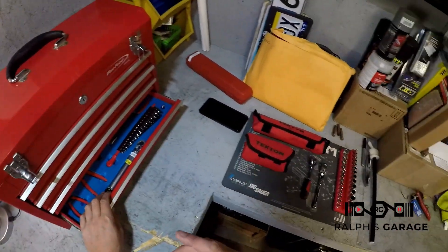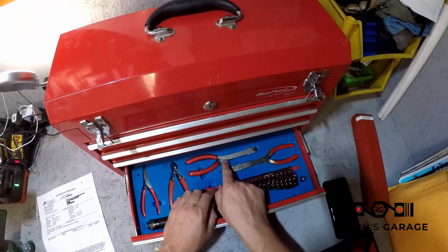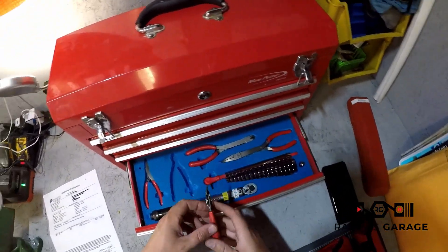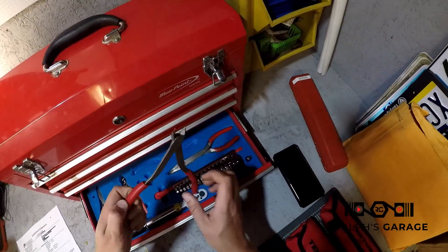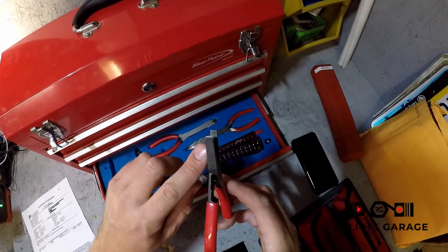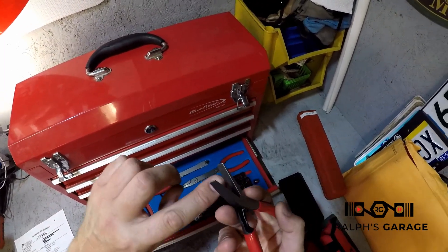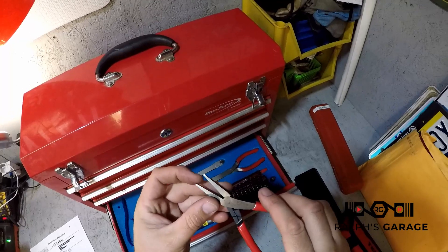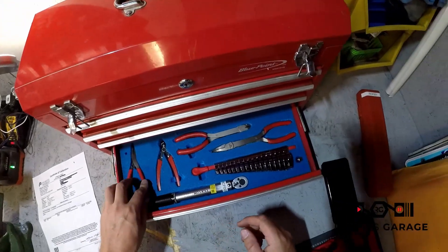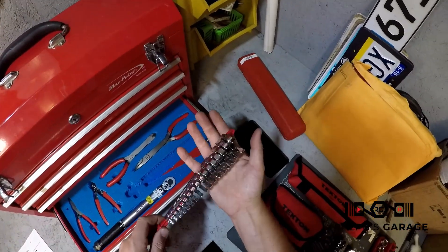Tekton as a tool company — I have a lot of their tools. These little flush cut jobbers are Harbor Freight, these are Snap-on. This Tekton piece is a nice little tiny duck bill, and the thing about it is it doesn't have any grooves inside — it's smooth. So if you're doing safety wire, it won't leave groove marks in the wire. Pretty nice and handy.